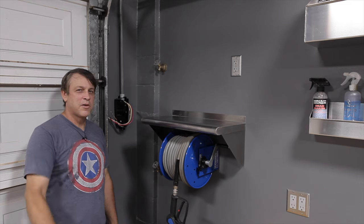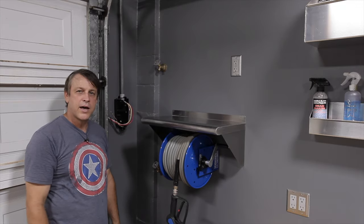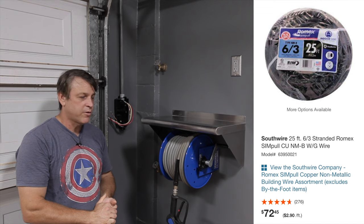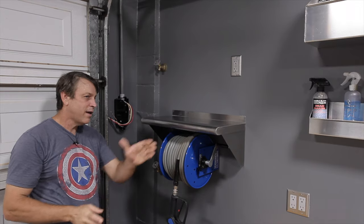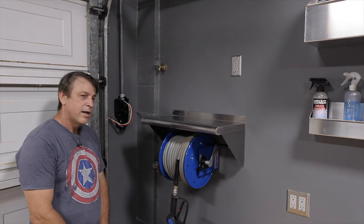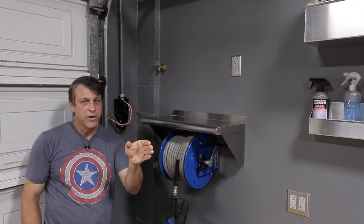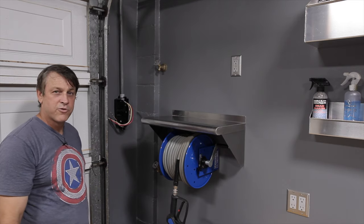Since there are so many ways that you can run the wiring — through the drywall, in conduit outside the drywall, or through the attic or ceiling — I chose to run mine through the attic and ceiling and down the wall with conduit. I went with 6 AWG wire, which is pretty thick gauge, and I have a Tesla Model 3 Standard Range Plus that calls for a 40 amp circuit. It's about a 20-foot run from the breaker box to the wall connector, so with all the math done, that's a good size wire for the job. When purchasing wire, don't measure the exact amount — put five to six feet extra on the breaker box side and two to three feet extra on the wall connector side. It's a couple dollars a foot, but it's way better than being short.